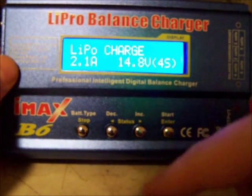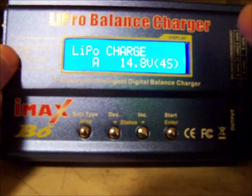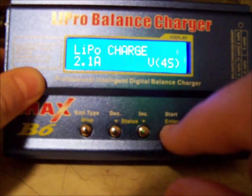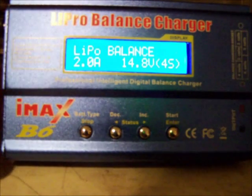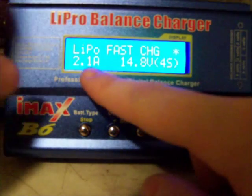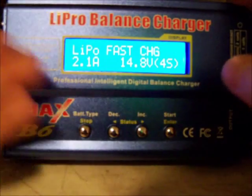Now you go to your LiPo charge settings. That was just setting up your LiPo — basically they are asking you what kind of LiPo you have. Depending on what kind of LiPo charge you want, I'm not going to mess with this now because it's already set up. Whatever MAH — that was a 3800 — so you would charge at 3.8 amps. It would be 14.8 volts and it even says over here what cell it is, so it is a 4S LiPo. You move over and it says LiPo balance — basically just when you plug it in, to balance it. When you plug it in it will charge at that rate. When you're doing amperage with LiPo, whatever your MAH is, that's the charge rate.